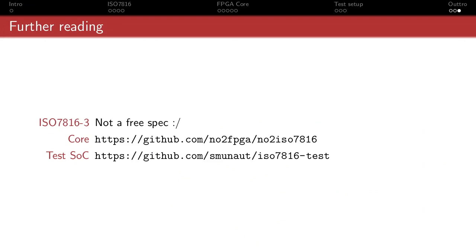Yeah, thanks for the explanation. I mean, my stupid idea would be then to have something like a configurable divider and a shorter shift register, but I'm not sure, as you know, I have no clue about FPGA development. Yeah, but that's the thing, the configurable divider is probably going to take the same amount: the configuration register for the divider plus the divider itself is probably going to take the same amount of logic as just having the full number of bits in the wait timer, basically. That's sort of how it works.